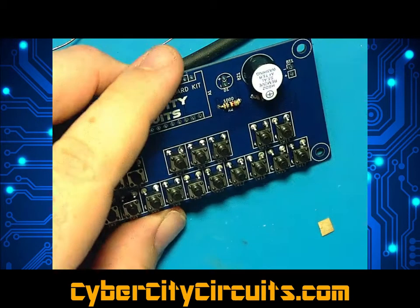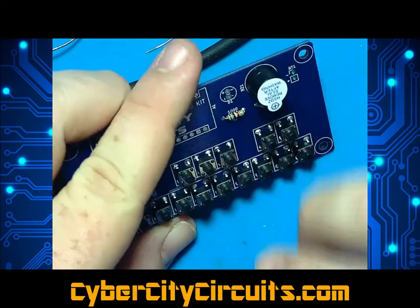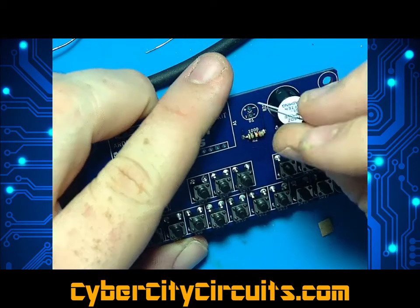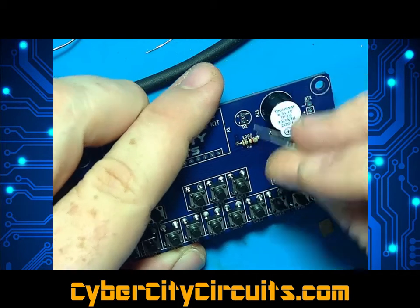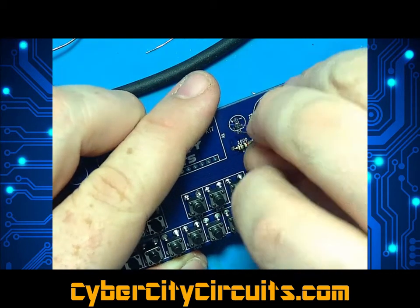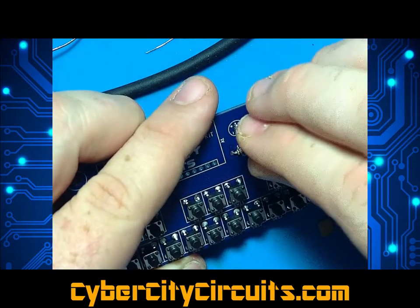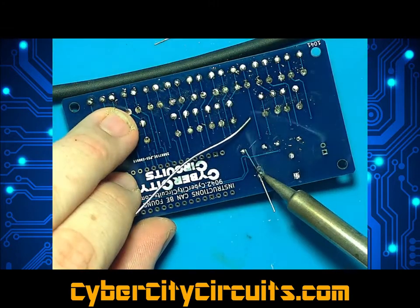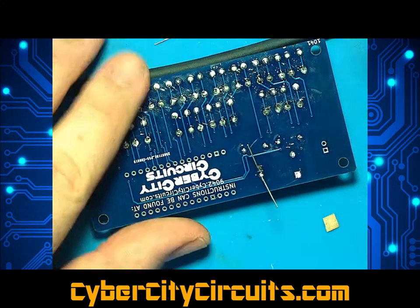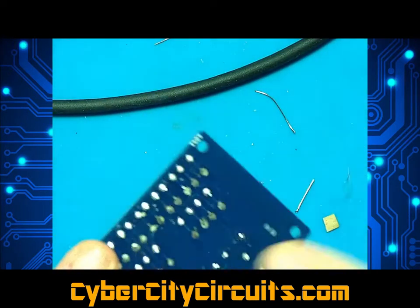And then I'm going to put my LED on it. And again, the LED has a long leg and a short leg. The long leg is positive. You see there's a long line next to it. The short leg is negative. And it has to go that way or else it will not work. And I'll clip those leads. And now we're almost done.